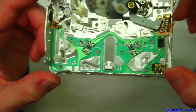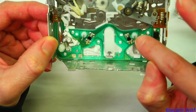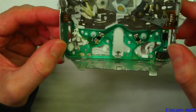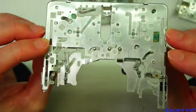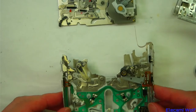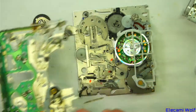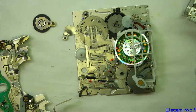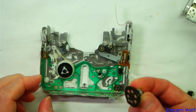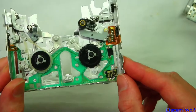I've put a little bit of epoxy resin glue — Araldite — onto those after cleaning them with isopropyl alcohol. Hopefully they're lined up — they seem to snap into place, so it should be aligned straight. That's going to get left overnight, and we'll see what happens in 24 hours. These shafts are now nicely set in place. I've put back the supply reel and it's working fine. The take-up reel can go back on and works fine.